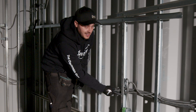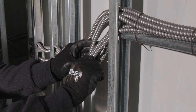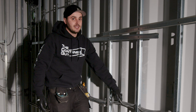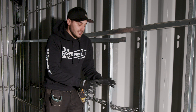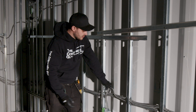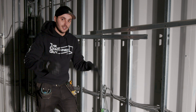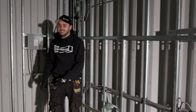A lot of this wiring we want to keep far enough from the wall, but not so far that the foam pushes it out and we can't finish. What we've done here is taken half-inch conduit, ran that through a lot of the electrical holes, and used some chicken wire to wire everything up. This is our bush fix for this job and hopefully allows for a nice gap of foam behind all the electrical. Because as power travels through these wires, it's hot — it's creating heat. If these wires are right up against the outside of the container and all the foam's there, that's going to condensate and all your water is going to drip right into your electrical. Water and electrical do not mix.